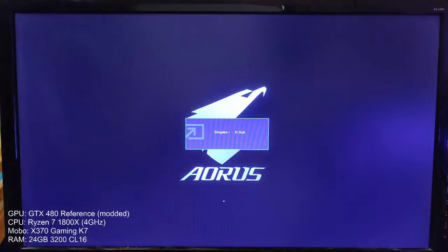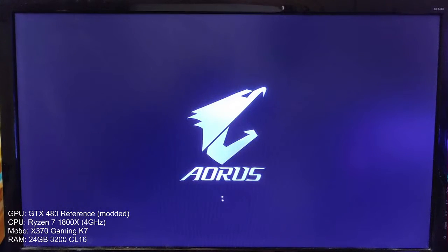28B4? No, okay, it's booting. Or not. Oh, don't tell me it's not getting detected now. Yeah, it's not getting detected. So that's a really annoying thing that this also does. It just won't boot PCI Express 2.0 cards sometimes. And it seems like it's doing that right now. 27, 15. Come on, give me B2. Yeah, it's going through some postcodes. B2? No? Wait, it's boot looping. B2 98. Hey! Pressing the reset button solved it. Dodged a bullet right there.